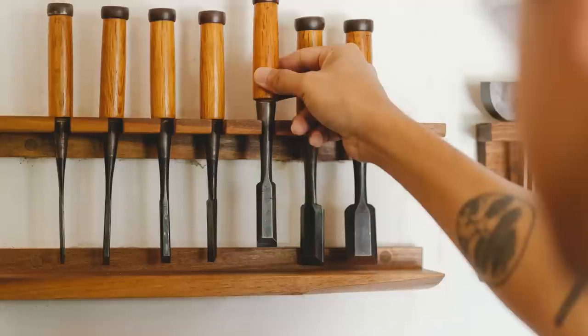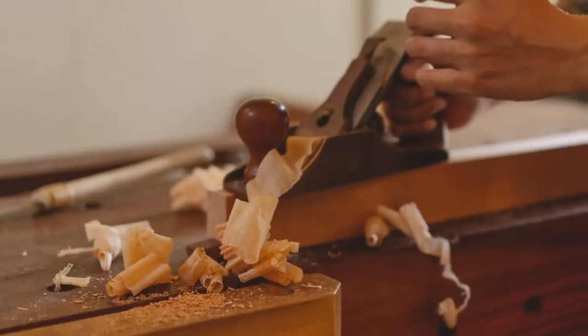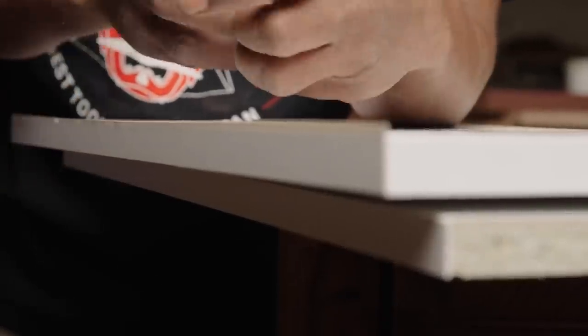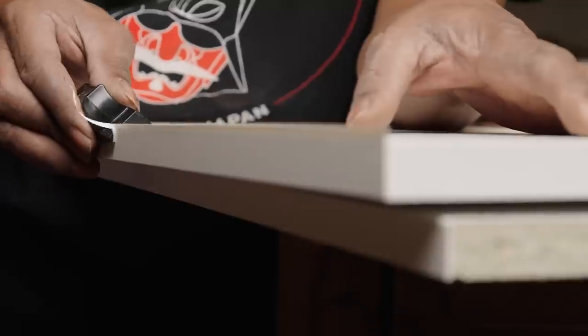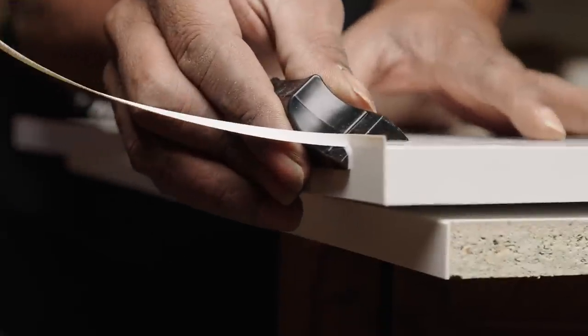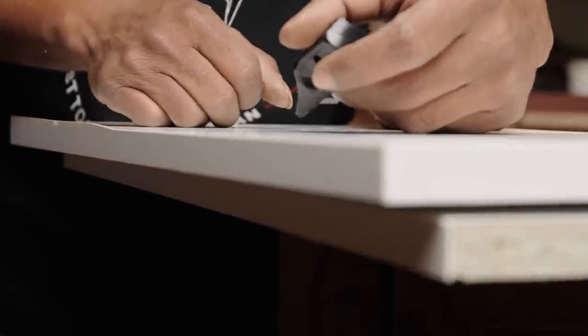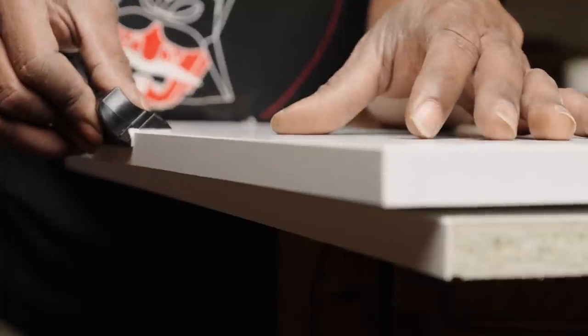Normally you would use a chisel or a planer blade to do this and then you'd have to file the sides down. It takes a long time and also you have the danger of the chisel or the planer blade digging into the board. This edging here is just the stick-on edging and that's 0.3 millimeter, so the 0.3 mil ceramic edge trimmer is perfect for this. I've done that very slowly for the benefit of the camera but you can go a little bit faster.